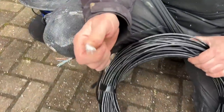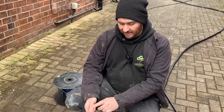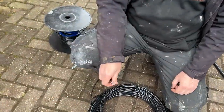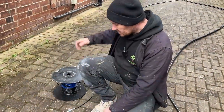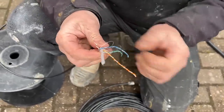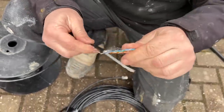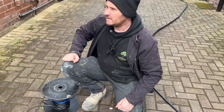John explains: I've put RJ45 connectors on both ends of the CAT6. Because the run is so long, it's worth wasting two connectors - I've tested it with my tester to make sure we've got continuity on all eight cables, and we have. So as long as nobody chops through it, we know this cable is perfect. This is exterior-grade CAT6 with a plastic tube inside for structural strength so you can't snap the cores when bending it.